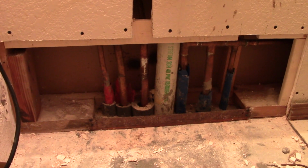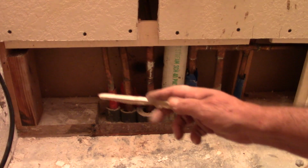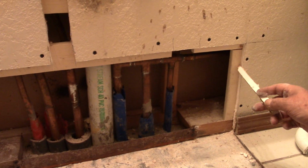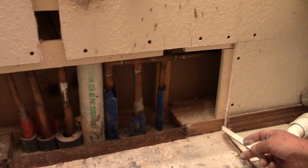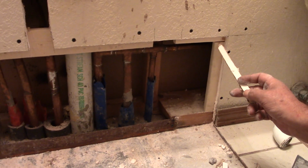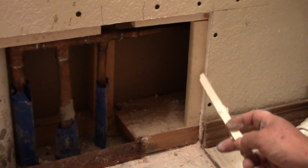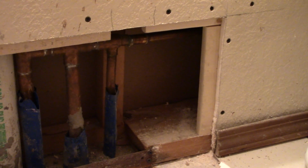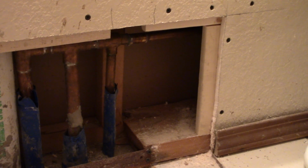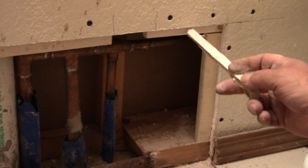Okay, tell me what you did this morning. Well, this morning was fitting up the supports for the drywall. The space between here and over here is 30 inches, and from here down to here is 11 inches. So I put in 2.5 by 1/2 inch strips of wood. So that's called scabbing, right? It's like an addition to, yeah, so that you could screw the drywall into the wood, so it will have some kind of support. Right, that way the drywall won't fall through.